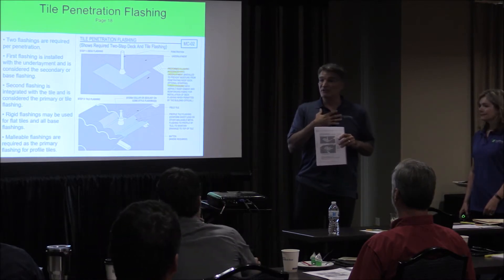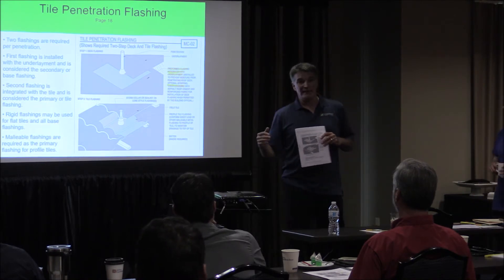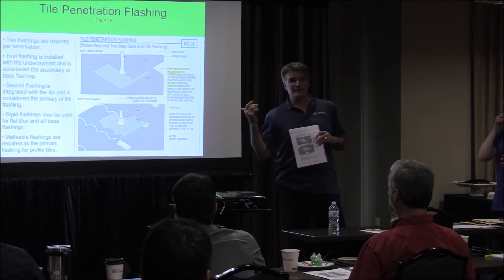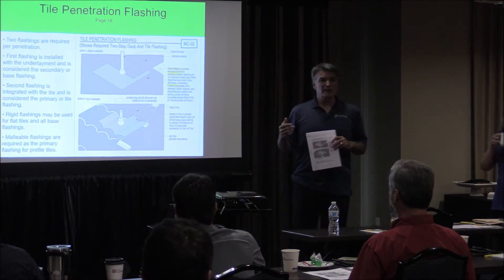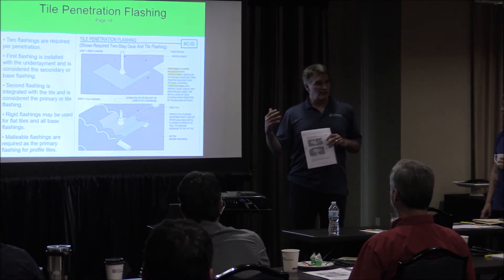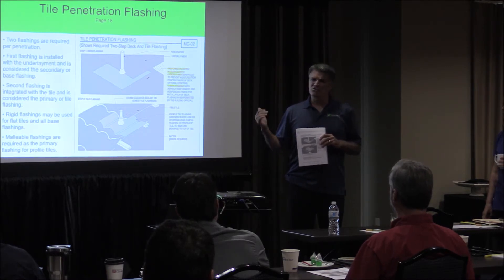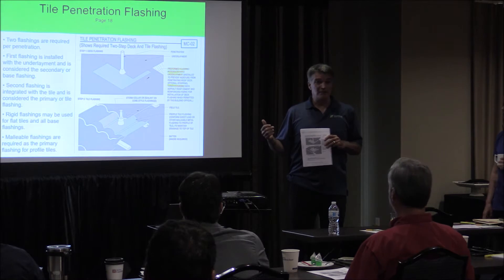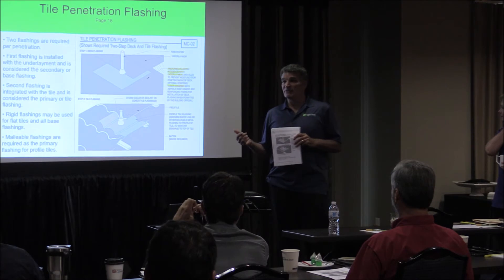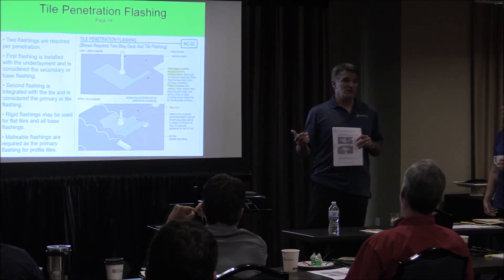I've never been a production contractor. I've never had to cut pennies on the dollar. I've been a high-end, quality-minded contractor. But I've never once done that. And that was my sales rep back in 1992 who said, if you're concerned about getting into tile or you want to just do high-end stuff, you want to do it to make more money and not hire more people, then just go quality. What do I do to go quality? Well, don't make mistakes. How do I not make mistakes? Have a good backup system. So I've always put two layers of 30 pounds down. That's my base installation — two layers of 30 pounds.